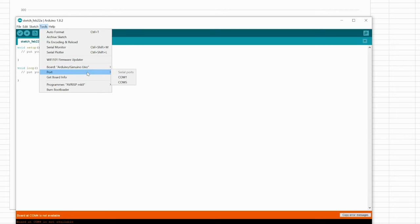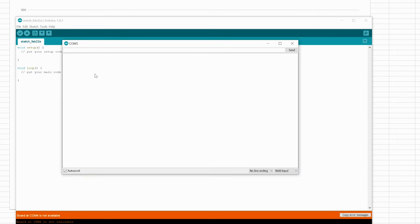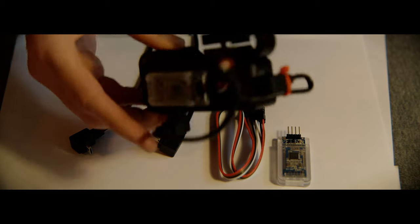There are a lot of existing tutorials on how to change the baud rate of the HM-10 Bluetooth module — they'll step through it better than I will. The best interface is still the Arduino serial interface. Once you connect your module to your UART adapter using the RX, TX, ground, and power pins, you can go into your serial port and use the AT+BAUD command to set it to 115,200 baud rate, then do a check to confirm it's saved.